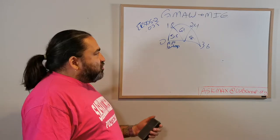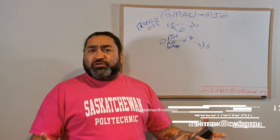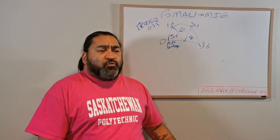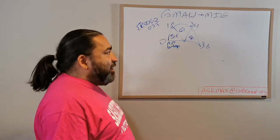It's strong. Lots of times people will say stick is stronger than MIG or GMAW, and that's simply not true. It's really based on the procedure, the type of wire, and the parent metal. It's how you do it. If you want to buy a weaker wire, then you buy a weaker wire. A 6010 has less tensile strength than a 7010, so it's just what you're buying.